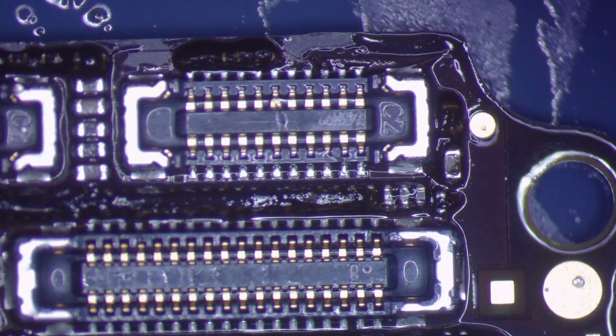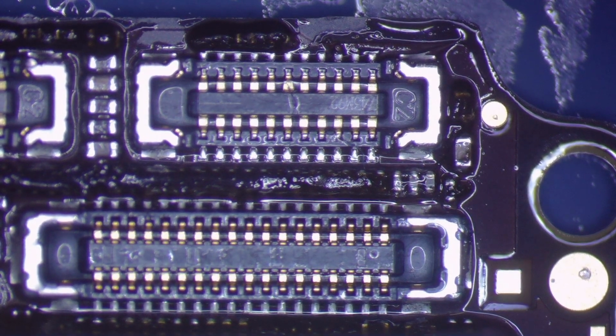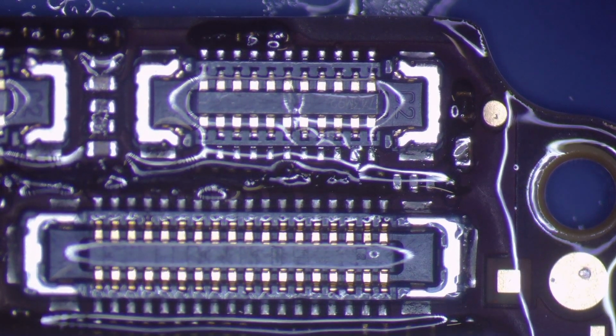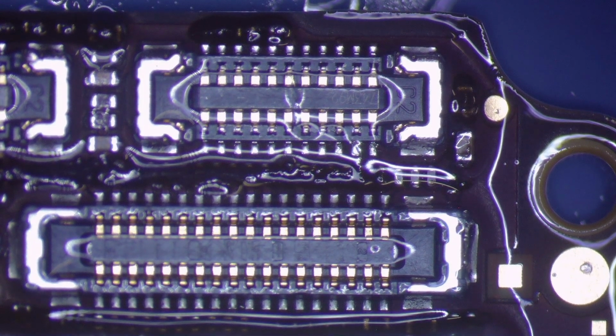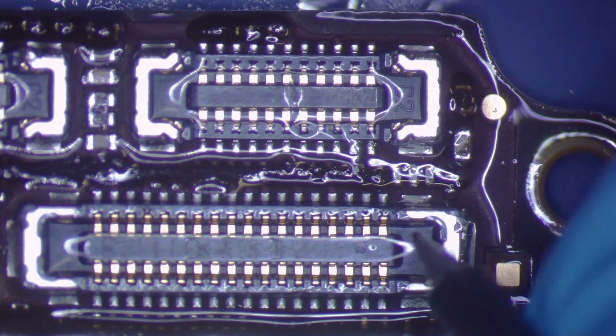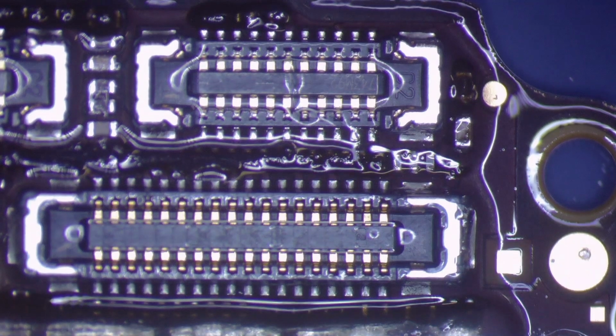So what I did here was I injected actually at the pin. So I'm going to add a bit more ISO, and you guys can see exactly what I'm looking at. All right, so we're going to again inject at the pin and look at what's getting hot there. Can you guys see it bubbling? It's the fuse that's getting hot.